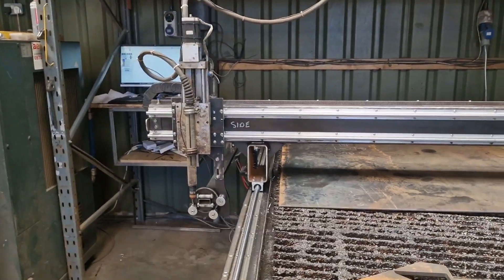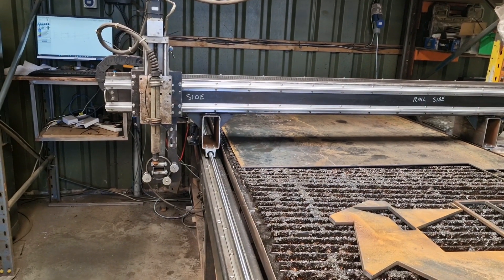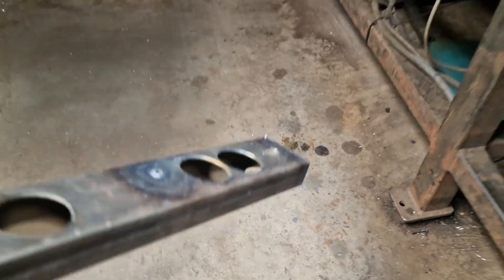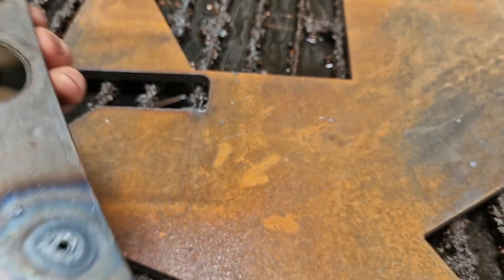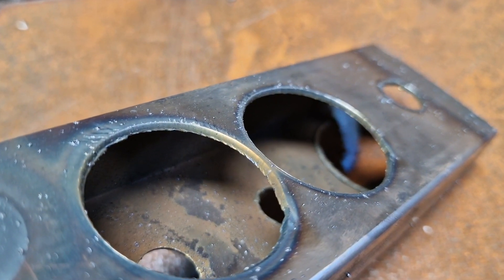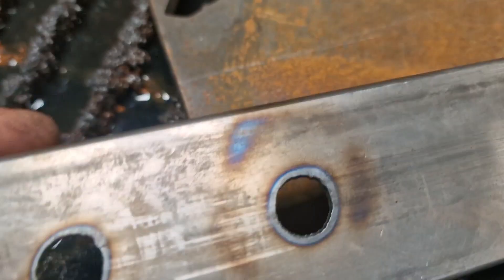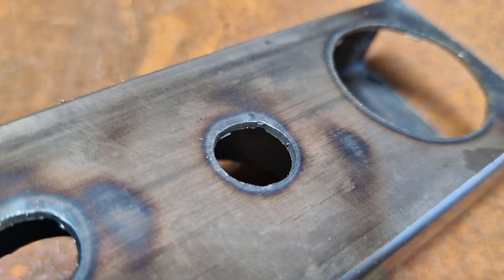All the bearings are brand new on it. They use the same rail. I'll get a tube demo going in a minute and then you can see how much better it cuts. If you look at the cut there, that is a lovely smooth cut. Some of these previous cuts have got a little bit of judder, torch wobble and stuff like that — even more so on the not-so-round holes. If you look at that, that's a little bit messy, whereas that is a much, much cleaner hole.